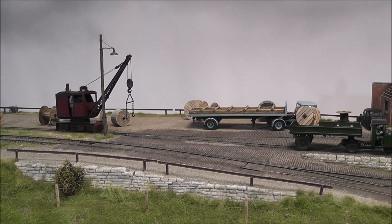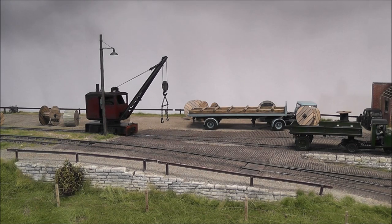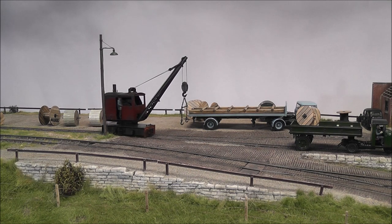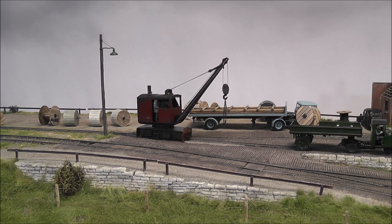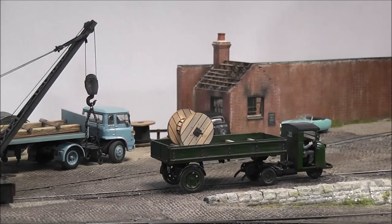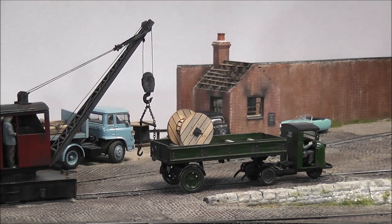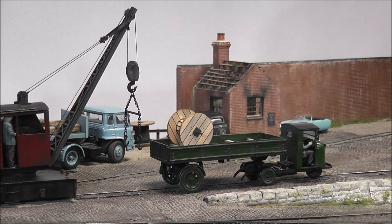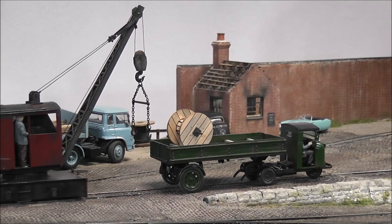The steam crane is operated by a Jumper T8SG two-stick transmitter configured for land use. The transmitter is also programmable with its own deviation software, which means I can reverse outputs should I so wish, and also bind with many other models, though of course you can't operate them at the same time. The output strength is also variable, which may help to minimise interference for others, as well as maximise battery life.